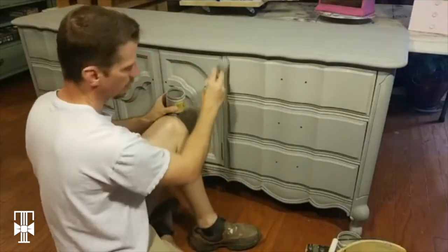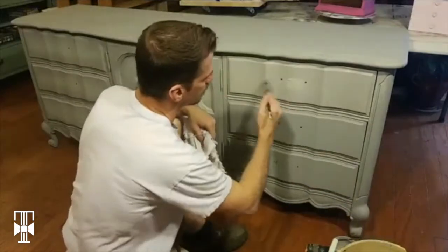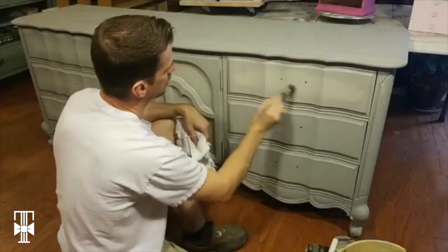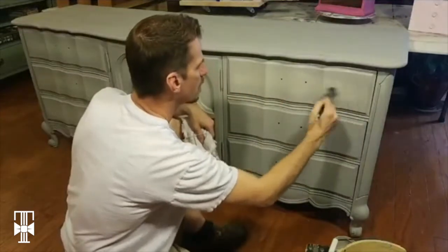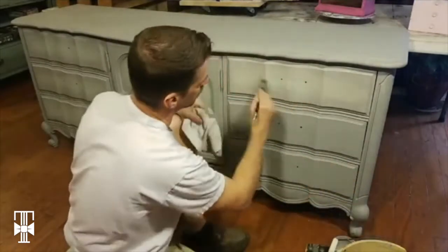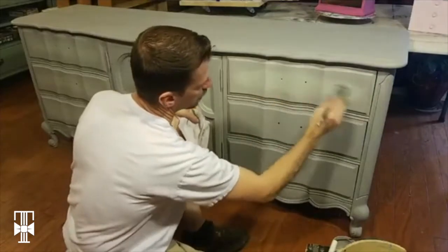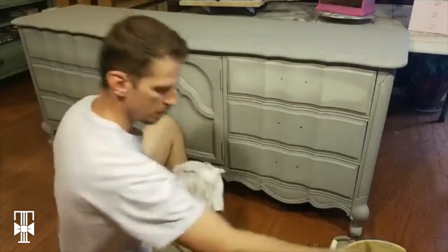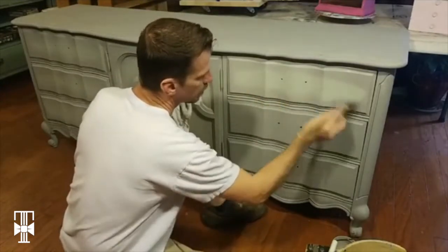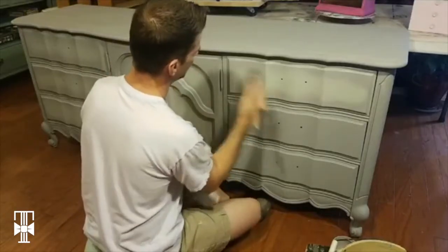First coat. I don't want this color to go all the way across — I just want it towards the middle. So if I get too far, I'll just come back in a minute. With chalk paint I should still be able to do some dry blending. Sea Glass — spread it out a little bit. A little bit of water. It's okay to go back and forth, up and down; you're trying to blend that into the other grays that are there. Just make sure when you're done, you get a nice horizontal feathering.